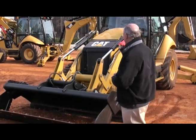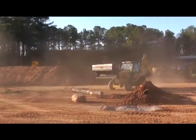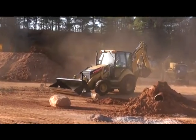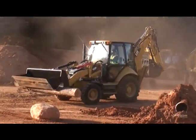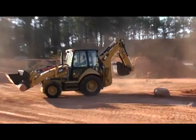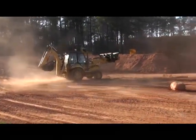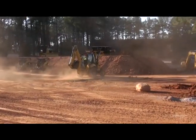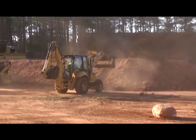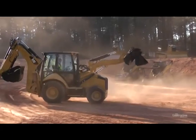New on our F-Series to increase performance, we've put a whole new front loader on all of our machines. When you look at lifting a load up to max height, we've increased that maximum load capability by 12% on the single tilt machines like the 416, and 13% on the integrated tool carrying machines like this 420 IT. We've also got about 7 more inches of clearance when loading into trucks.